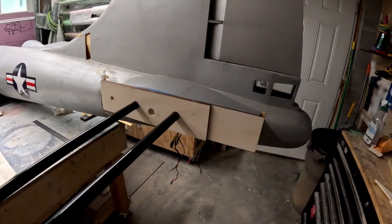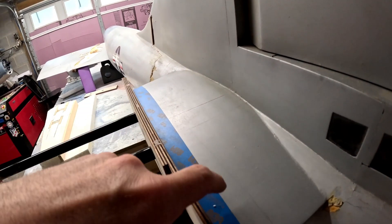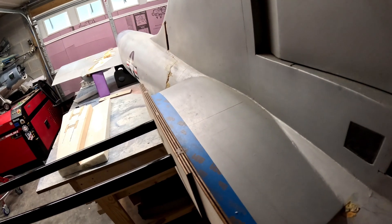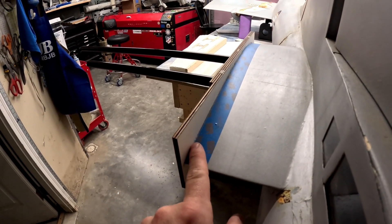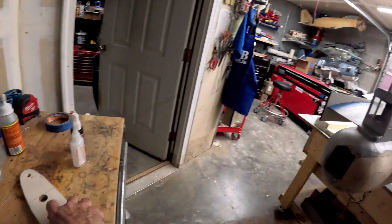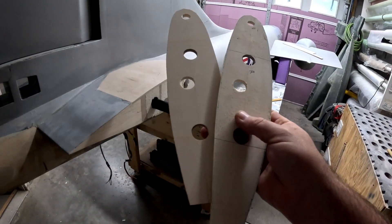Next, for making these horizontal stabs removable, I've put some painters tape right along the edge on the top and then tack glued the rib blank in place. I traced the shape of the airfoil stub onto the plywood on both sides — this side I've already taken off and trimmed. Once the shape is cut, before cutting I laminated the two ribs on the edges together that make the stub and the stab itself.